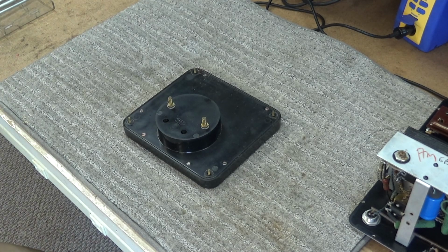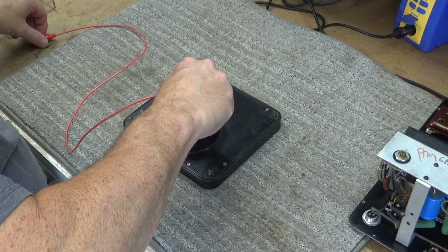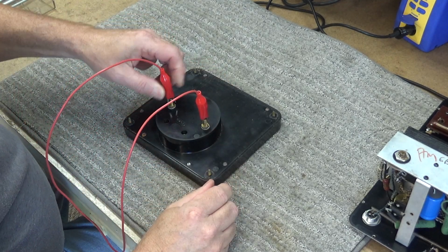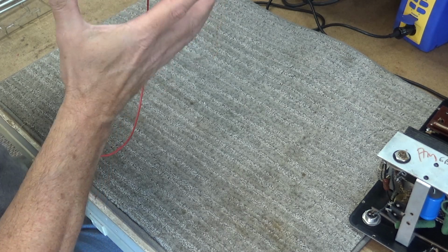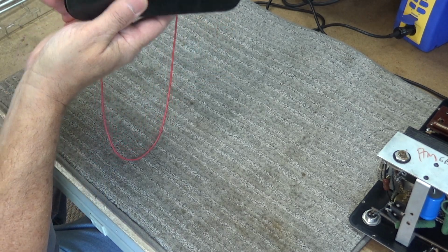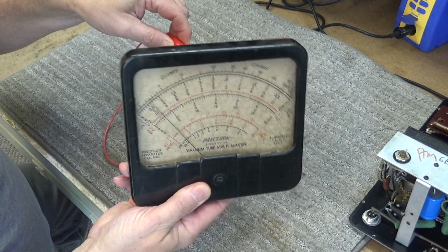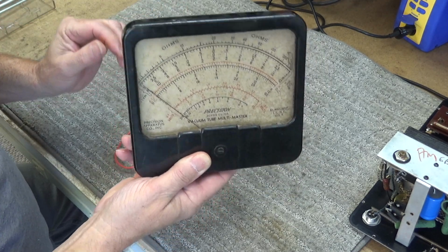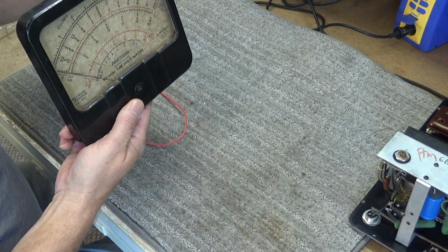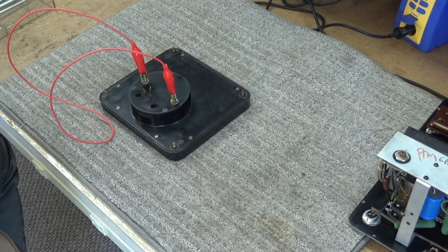First off, now you could take solder or something like that and run across this. But basically all that does is short that meter movement. See how the meter movement is locked? Where you at? There you are. See how the meter movement's locked? And if I take the jumper off, you see how it flops around? You put that jumper across the meter and it shunts it. It helps keep the meter from being damaged. Long story short.